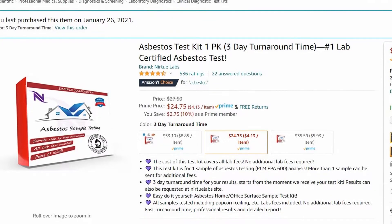I don't think it's asbestos, but just to be safe before I go pull this ceiling out, I want to have it tested. The test kit I bought only cost $25, and you still have to pay for a stamp when you mail it in, so it's about $25.50 all said and done. You basically take a sample yourself, send it off, wait a few days, and they mail you the results back — a nice quick and dirty way to make sure you're being safe on a project like this.